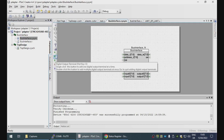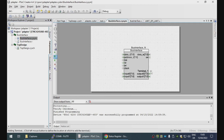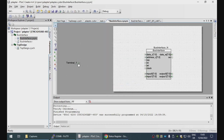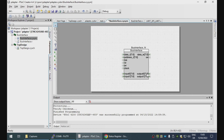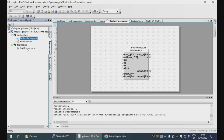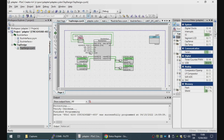We're going to need to add another output terminal. Do we? See, I'm wondering if we need to add output enable lines for output 0 and output 1. So that this now becomes data write output enable, and each of these gets its own. Then output 0 goes through a latch, and I think we have some.